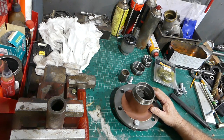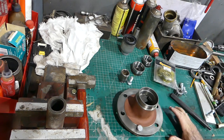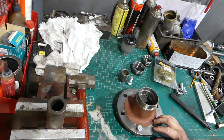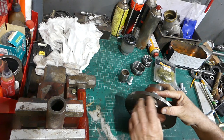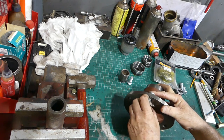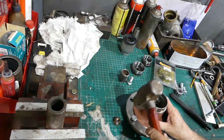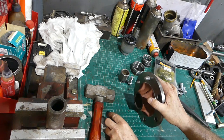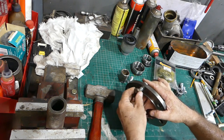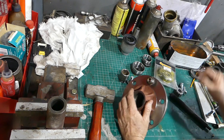What I might try and do first is fit a couple of these wheel studs. To fit the wheel studs, there's 20 ways of doing it. I'll try and show you a couple at least. This is fairly easy and probably a good idea if the hub is still on the tractor. All you do is get a big hammer, just start the stud — all you're looking at is so it doesn't turn. Then I like to put a spare front wheel nut on backwards.